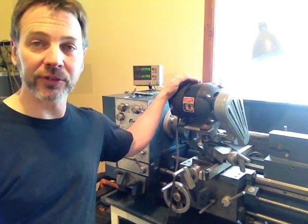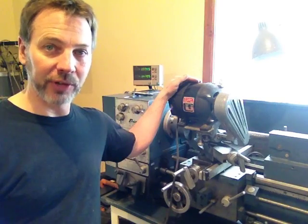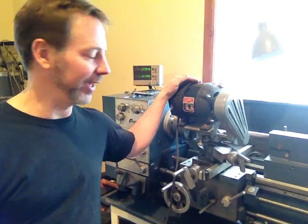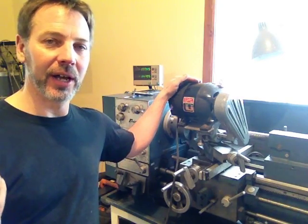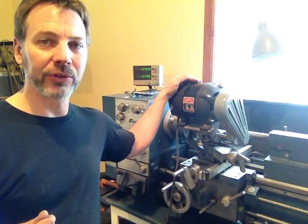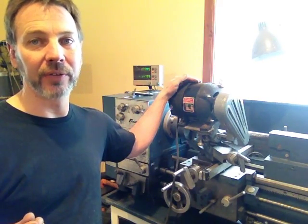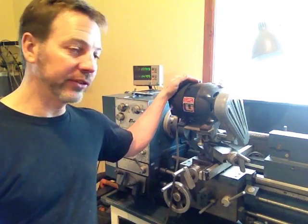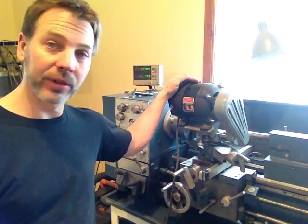We will end up having to dress the stone. I don't have a diamond dresser for this right now — somewhere in my shop, we've all experienced that, can't find it. But I'm pretty confident I can just get this done old school: grind it out very carefully, then take a stone to it and sharpen it up that way. So let's go to work.